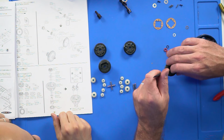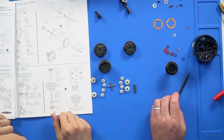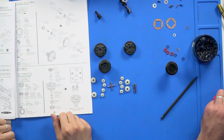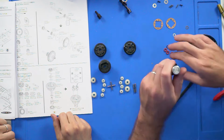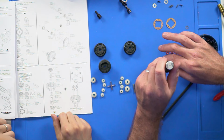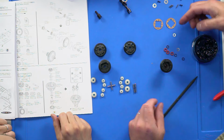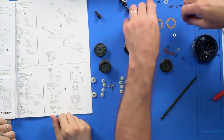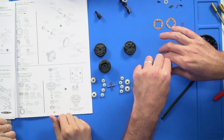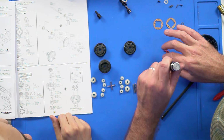And the best way to get these settled, like I said, I don't like using sharp tools around my O-rings, is actually to get one of these clean drivers. Just push it in evenly all around? Yeah. That's a 5.5mm driver. You just want to make sure that you haven't been using it on other stuff and it's all dirty. And then the big shim goes on. They're wafer thin. And then the pin goes through. I'm just locating it again with my 5.5mm.